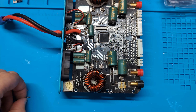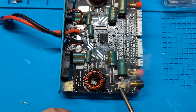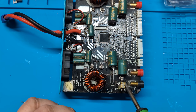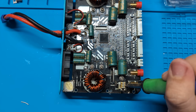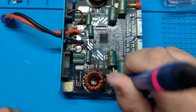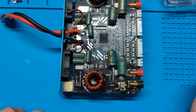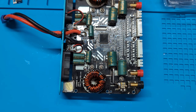I'm going to add some flux as per usual, because low-melt solder often does not have any flux in it. Just melt that a little bit and add it on there, start spreading it onto the fuses. Do the same on the other side, being careful to avoid the little resistor down there. You can already see they're moving around a little bit. You can do it with your soldering iron, but it makes it a little easier if you have a heat gun to actually pull them off because you can just tweeze them off one at a time.